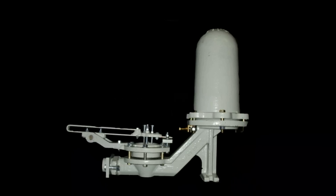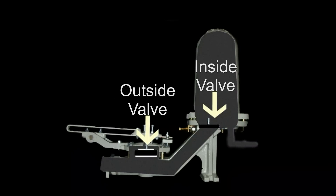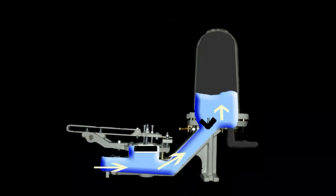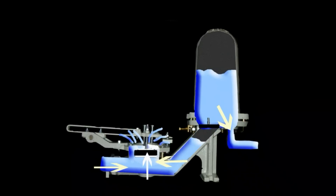How does the rife ram work? The water supply flows down a drive pipe to the rife ram. The self-starting cycle starts with the outside valve open and the inside valve closed. Water falls down the drive pipe, gushing out the outside valve. When the water reaches a certain velocity, water friction closes the outside valve. The water's momentum, called a water hammer, forces open the inside valve, which forces water up the delivery pipe and pressurizes the air in the chamber.